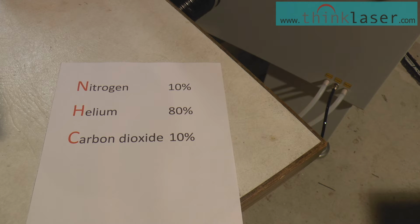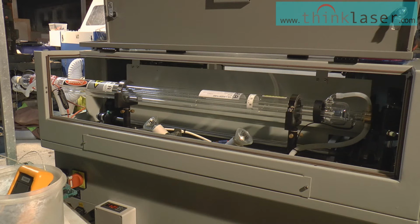All of these gases are non-conductors naturally. Even as it's sitting there, this tube is being bombarded by cosmic rays from the sun. I know it's night time, but they pass through the earth, they pass through anything and everything, and there will be some cosmic rays which will actually be colliding with some of the nitrogen atoms that are in that tube. There might only be 1 or 2 or 3. That's enough to start a chain reaction off at any point in time that we wish to turn the laser on. Now to get current flow you need basically some free electrons, or electrons that are knocked out of their orbital shells. Let's not get too involved with the atomic physics because I'm certainly not a physicist.